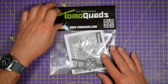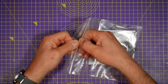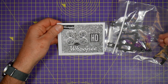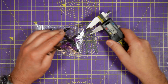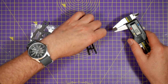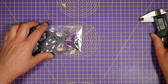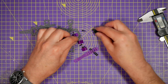Here are the components I've chosen for my Whoopi build. First off is the Whoopi HD V2 Cinematic Nano Frame Kit from TomoQuads. I've used quite a few frames from TomoQuads and they're really well designed, great value and even though I'm in the UK they're delivered pretty fast. This is a 92mm frame made from 1mm 3K carbon and it's cleverly designed with holes for a 16x16 or 20x20 flight stack or even a diagonally mounted Beta 75X or Mobula stack.